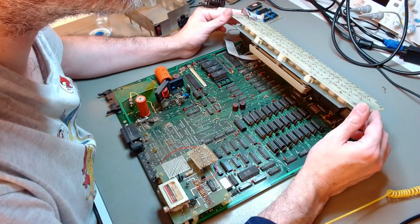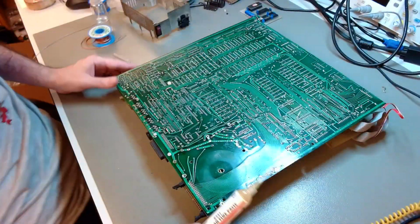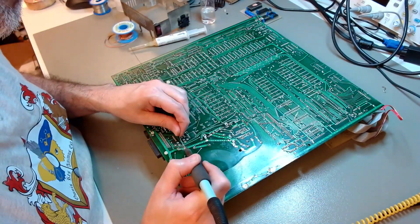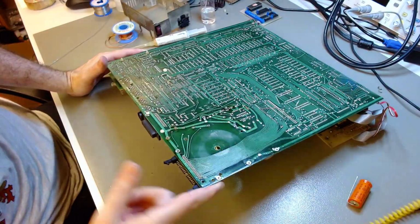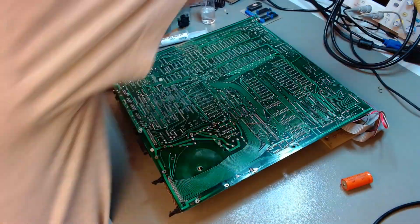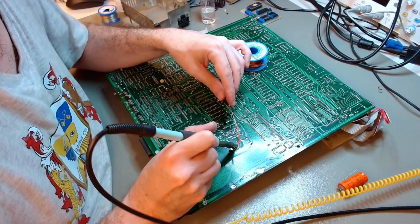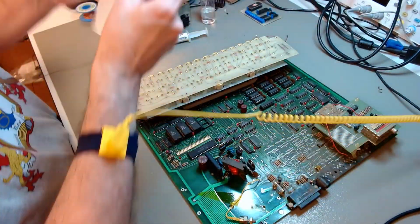They will test more or less okay. In one of them, the capacitance is higher, which many people think means the capacitor is okay: higher capacitance, the ESR is okay, so it's a good cap. Often it's not. If the cap is leaking DC current, the multimeter will read that leak as if it were higher capacitance, because it will take longer to charge the capacitor fully, since there is DC leaking across the two plates of the capacitor. The multimeter would then tell you that it has a higher capacitance, while in fact it doesn't. It just has DC leakage. So you have to be careful with that. It's not only ESR, the equivalent series resistance, that is important. The equivalent parallel resistance, which corresponds to DC leakage, is also important.